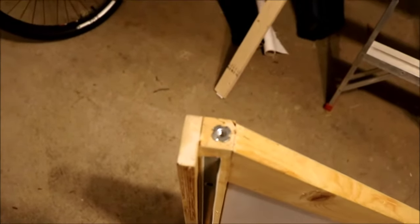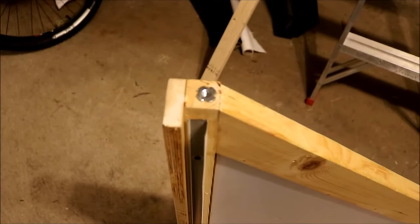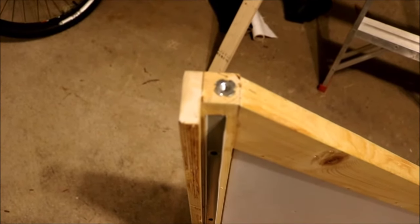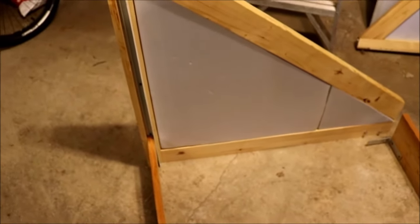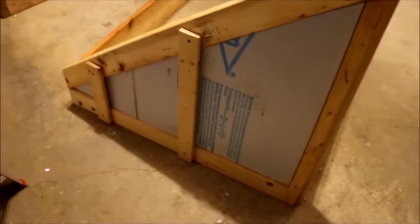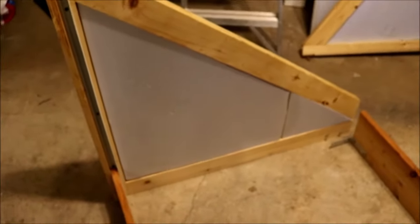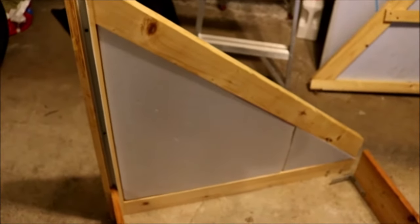At the top, where the front glazing goes, there's a threaded insert pounded in with epoxy so a quarter-twenty bolt can hold the front glazing on. I also put in some rigid styrofoam board — just press fit in place. On the other side, there are 1x3s giving a little more rigidity to the ends at the sidewall. I could put another 1x3 to hold the styrofoam in place, but it wasn't necessary — I cut it and it's stuck in there.